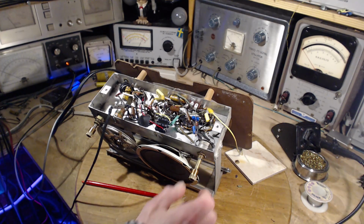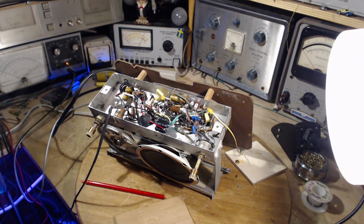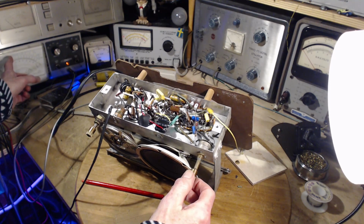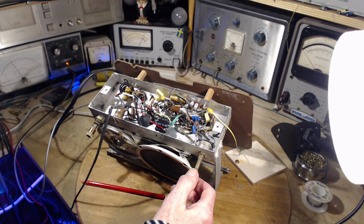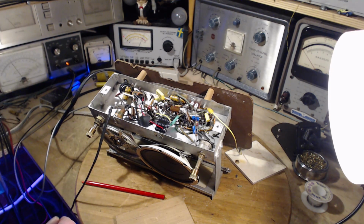Okay. Put the radio upside down because I'm sure it doesn't really make a difference. Here we go. Keep our eye on this meter, and listen. Five is about here. Wow, why so long? There it goes. It's not this voltage. This is just getting to where it should be. I've got the dim bulbs in the circuit, so the radio is running at 103, so this should be a little low. That's not what's quieting it.